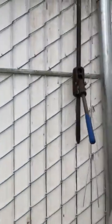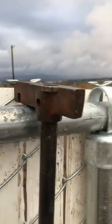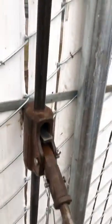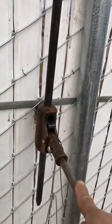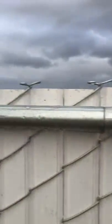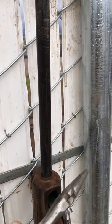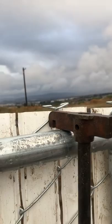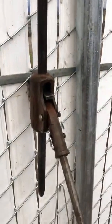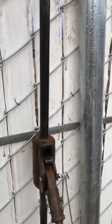Then come on up and hook your pull jack up on your top rail right here like this. You can just jack it up as high as you want to get it spot tied where you need it. Then you can just tap this tool to let it down to where you want it. It's called the pull jack — that's the tool for lifting it up.